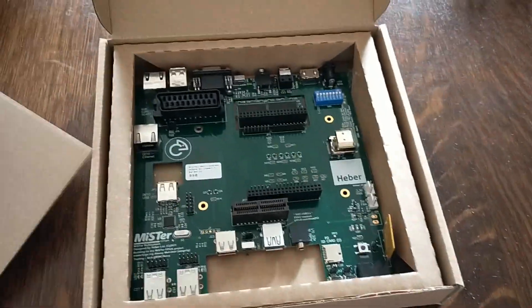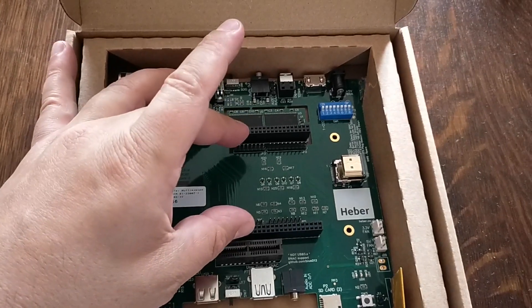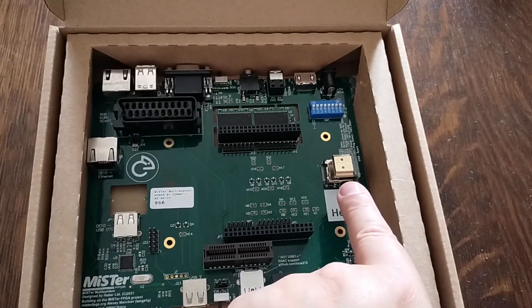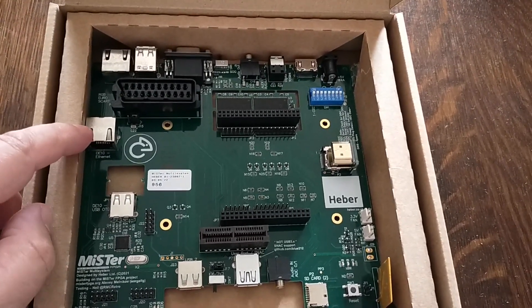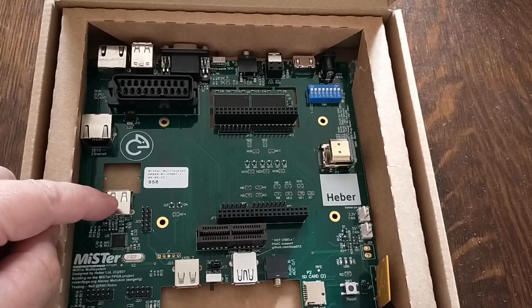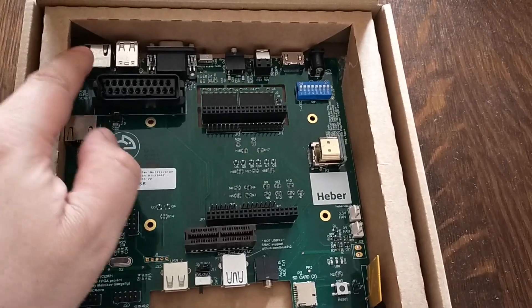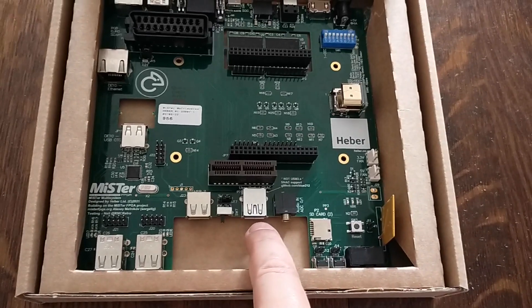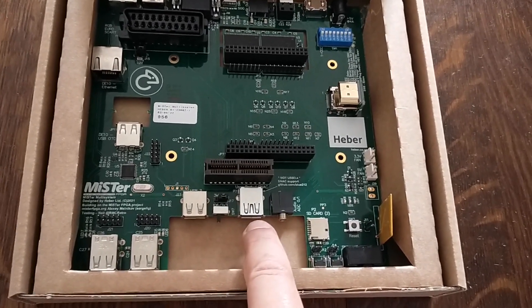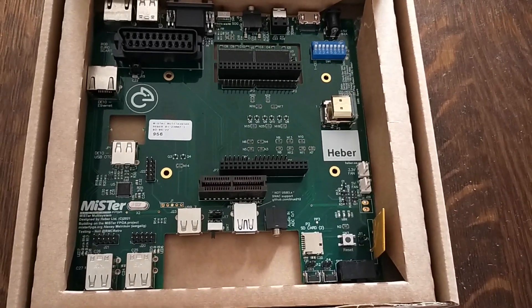Let's get this assembled. Inside the cardboard box you've got the motherboard with your SCART socket, the connectors for your MiSTer itself, a little HDMI bridge which you're going to need to remove, an Ethernet adapter, and an OTG USB adapter. There are a load of connectors across the back for your output, and also USB on the front — but please note this is a SNAC connector, not a USB socket. There's also a second SD card slot and two fan headers.